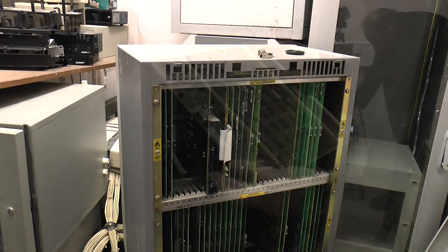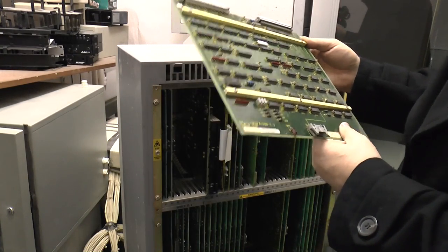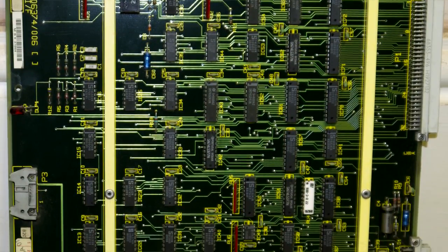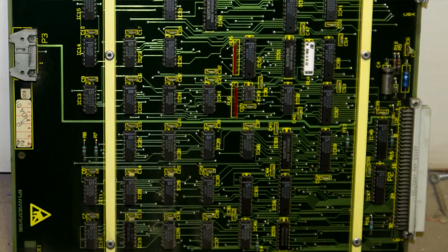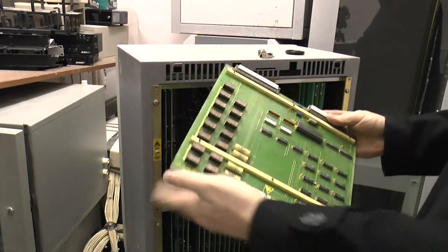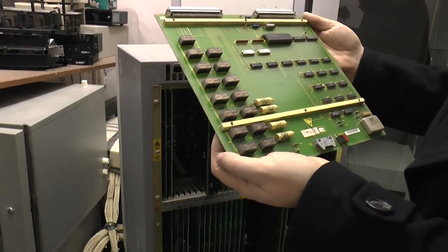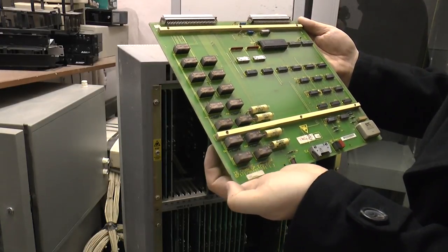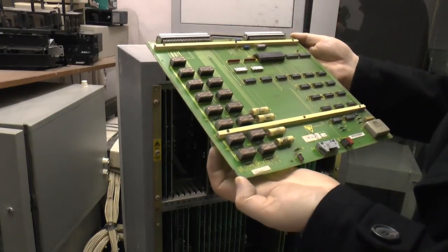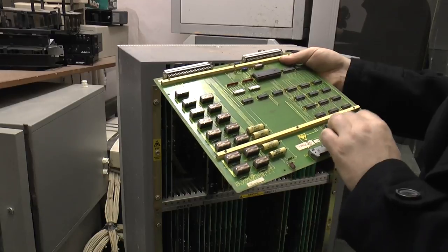All good fun. It made a big difference when the newer cards came out. Shelf interface — again we've got lots of 74LS series logic chips on here. Like I said, this is quite an old switch, perfectly functional but quite old. It's a 16-channel general purpose I/O board, running a CG9022N. The date code on here is 8935 — the 35th week of 1989. I should have been checking the date codes on these: 8944, 8927. That gives you an idea of the true age of this unit — it's about 24 years old. And there's a large 8 MHz crystal at the bottom end.